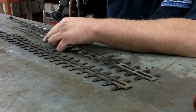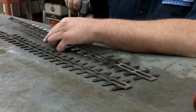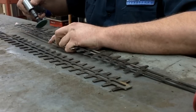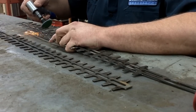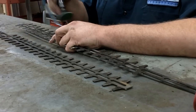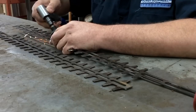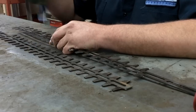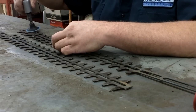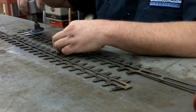Every now and then you'll come across one that's got a gouge in it from hitting a chain-link fence or something, and you may have to work it down just a little bit more to get the general idea. Once you're done, you can do the same thing on this side. Some people use a Dremel — this rotary die grinder seems to be the most cost-effective and easiest way to do it in my opinion. Once you get the actual edge, flip it over and just knock the burrs off the back side. You don't want to take a whole lot of metal off here because this is where the blades actually clamshell together.